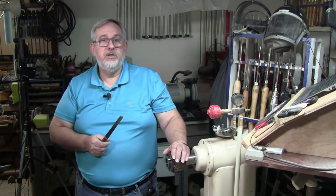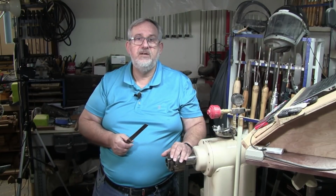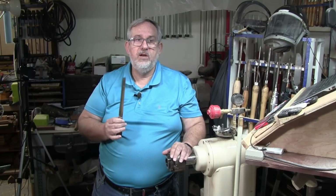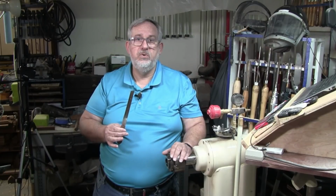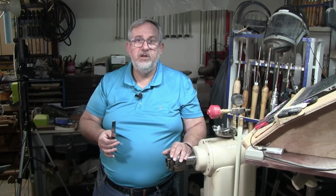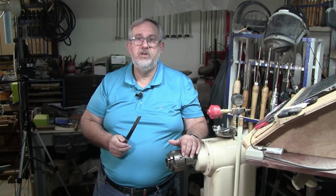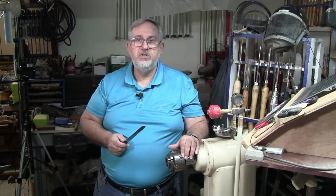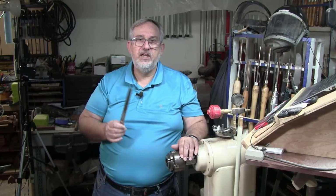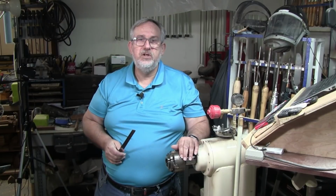One caution, and I'm not real sure, some of you guys are a whole lot smarter than me when it comes to CBN wheels, since I've gotten mine recently but haven't even gotten them on the grinder yet. But if I had a CBN wheel, I would really double check what grinding stainless steel on that is going to do. I know from what I've heard that you should never grind carbon steel on it, but I would just leave it up to you to make sure you're not doing something to harm your CBN wheels if you do have CBN. If you've still got the old rock wheels like I've still got on this one, hopefully by next week they won't be on there anymore, but right now they are. So I figured I would take advantage of that and go ahead and get this made for you folks. So let's turn around to the grinder and I'll show you exactly what I do, okay?